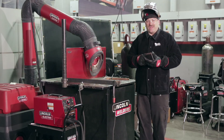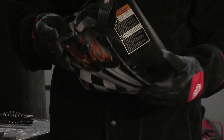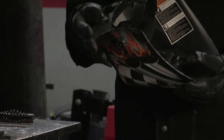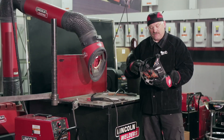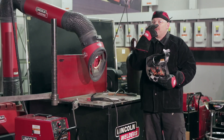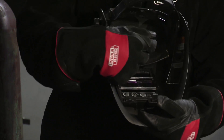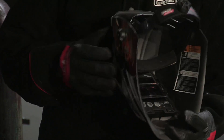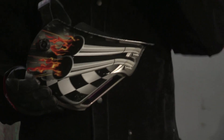I've also brought with me a flashlight to do that inspection with. A lot of people taking this test are starting to get a little bit older. When you get up over 40, 45, sometimes over 50, we start using reading glasses. Welding overhead, it's pretty difficult to use just the reading glasses because you're looking up. So what I like to use is what they call a diopter or cheater lens in my hood. I have a 250 diopter in here and that's going to help me see up there. I got to have that to see the seams and the edges.